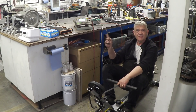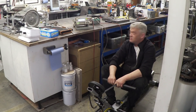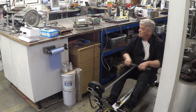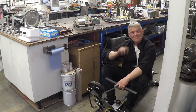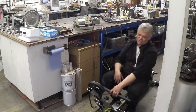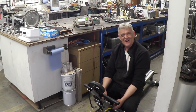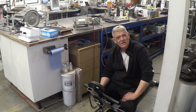I don't know if you're seeing that — that's half an amp. Let me put it onto volts. Okay, I've got it on volts, let's spin it up and give it a go. That's a mess — that was 33 volts at half an amp from that thing. That is an astonishing result. Now I did this as a Sunday project, taking a couple of hours on a Sunday afternoon, so it is a bit lashed together — the motor's jammed in with a bit of wood, we've got an elastic band as our fan belt — but given that result, that's well worth spending a bit more time on.